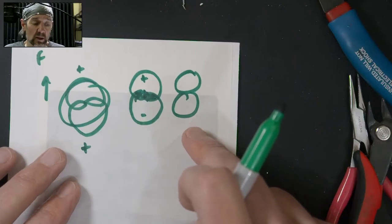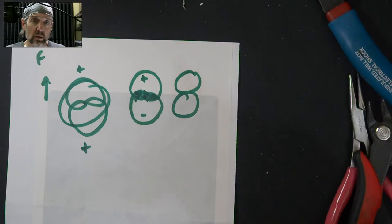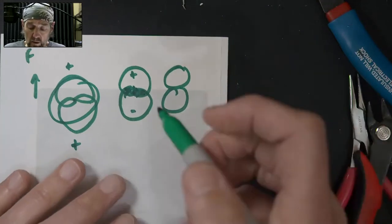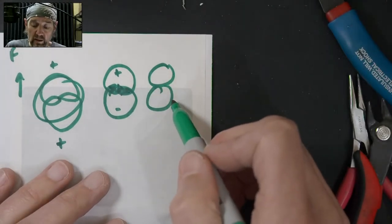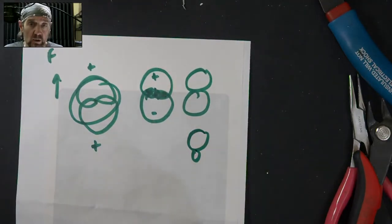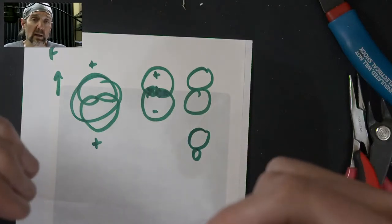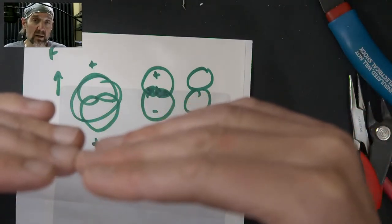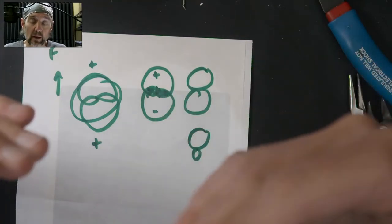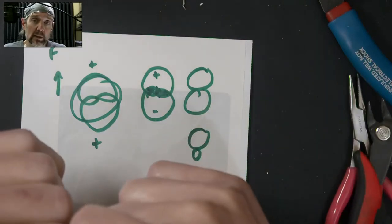If the mic has intermediate patterns like wide cardioid or hyper-cardioid, what it's doing is lowering the relative volume of the rear compared to the front — for example, figure-eight with a lower volume rear is basically hyper-cardioid. So if you have a microphone with two separate outputs, you can just do this in your DAW. You've got one track with front and one with rear, and you use a plugin to set the rear channel as either same polarity or inverted, then set its relative volume level — manufacturing any polar pattern after the fact. If people are interested in that, let me know. I also know some folks asked for a tube mic build — we could definitely do that.